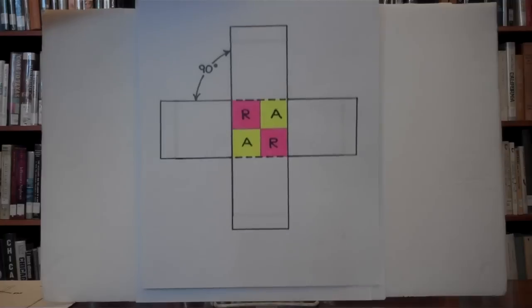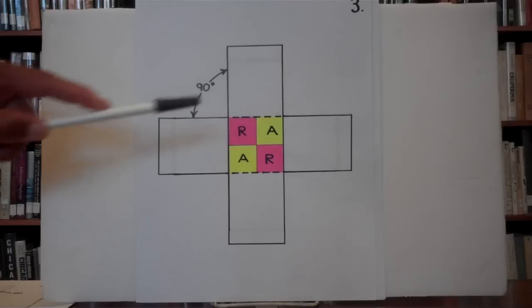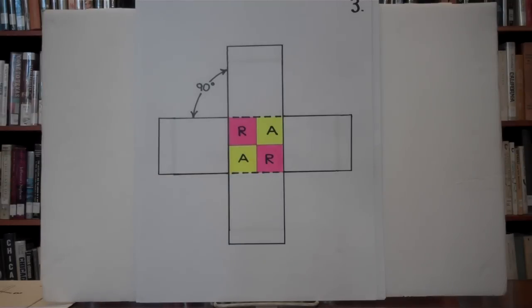Illustration number three. When two highly rectangular magnets such as this are turned 90 degrees to each other, centered, and their surfaces are touching or extremely near touching — such as one one-hundredth of an inch apart — their attractive and repulsive field forces become balanced. Attraction and attraction shown in yellow, repulsion and repulsion in red, with virtually no force needed to pull them apart. Rotating them 90 degrees to each other is equal to sliding them apart.